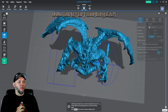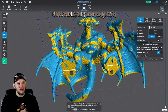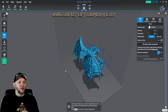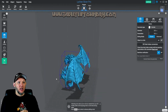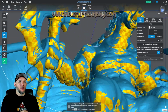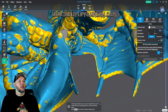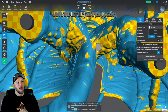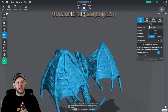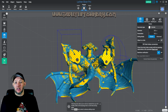The other thing we can look at that might be helpful is, even though there are no flat spots that touch the base, like this is always the best location, but it's not the only location. We know that when you're looking at the model, we're usually looking from this perspective. It's sitting on a table in front of us, and we're looking at it from one of these directions around the top of the model. So we know we can probably hide a support up under the leg or something like that. Like we might be able to hide a hole up here. So let's say a 3 millimeter hole here and a 3 millimeter hole here, right? Because that is not very visible, it's very unlikely you'll ever even notice the holes were there, but it gives us a little more room to add in isopropyl and clean and drain and do all of that.